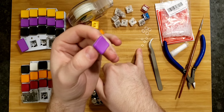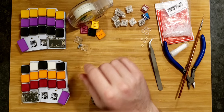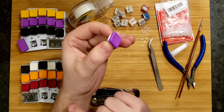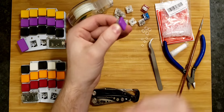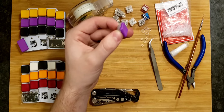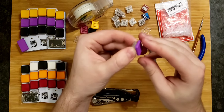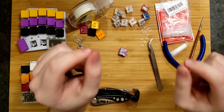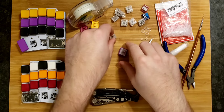I'm going to discuss orthodontic elastics at the end of the video during the sound test. Some people use them as an O-ring alternative — they're maybe not quite as quiet, but you get better travel distance, which is a worthwhile trade-off for some people. But we're going to get to the rest of the modding process, which is what really makes it quiet, and unfortunately this is the most tedious step: the tape mod.